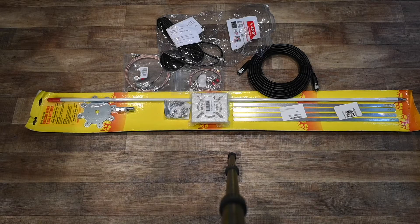Let's connect the base station antenna to the mast in the RV, get that up 25 feet in the air, and then I'm going to drive around in the car until I get marginal signal. Then I'll put the mobile antenna on top of the car and see if that improves it and see how much farther I can get.